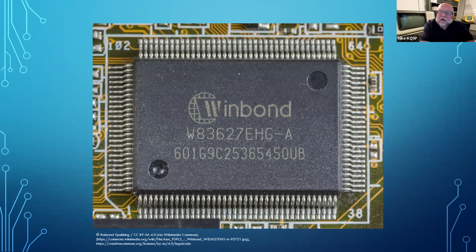I wanted to talk about the different kinds of packages. One of the reasons that new highly integrated devices like microcontrollers only come out as surface mount is that if you had to put wire leads on them, they would be huge. One of the projects I've designed uses a microcontroller with 240 pins. A chip with 240 traditional through-hole pins coming out of it would be colossal. That's why the new large-scale stuff like microcontrollers is coming out exclusively as surface mount.